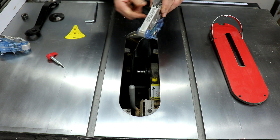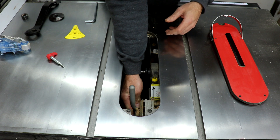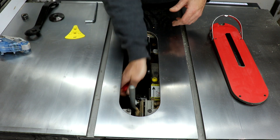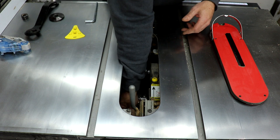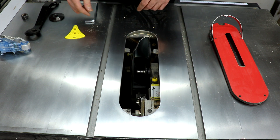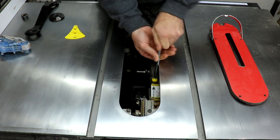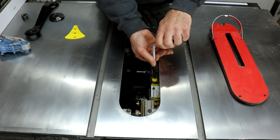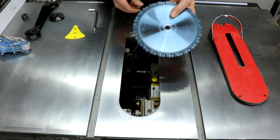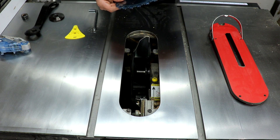Get your dado cartridge, make sure it's going in the right way — same application as before. Make sure it's on both pins, push it in, put the lock back in, and lock it down. Then you can rotate the riving knife out of your way because you won't be using it with the dado stack. I always rotate the cartridge adjustment down pretty far because it tends to hit the dado stack. Also, you'll need this closer for the dado stack because most dado stacks are 8 inch, not 10 inch, so it has to be a lot closer to the blade.